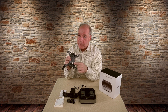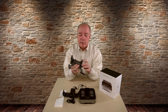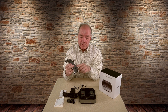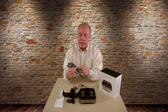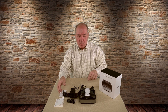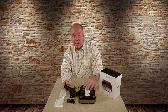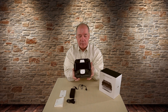One thing I want to talk about are these mysterious pads on the bottom of the Spark — a lot of us speculated what they were for, some thought contact charging, some thought wireless charging like the new iPhones. The truth is there are four pins in the bottom of the dock that marry up exactly with those gold pads on the Spark, and they charge through those contact points. There's intelligent circuitry — likely a diode bridge — that allows the charger to push electrons into the battery while preventing the battery from pushing them back in the wrong direction. You drop the Spark in, it hits those pads, fold the arms in, close the lid gently, and everything starts charging. The unit also has two rubber pads that gently press down on the Spark to ensure good contact — then it's a nice compact package you can throw in your backpack with the propellers underneath.